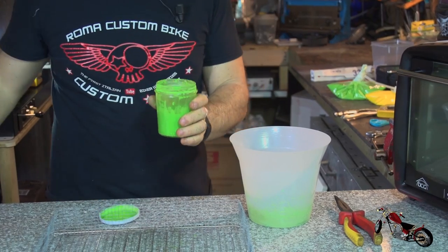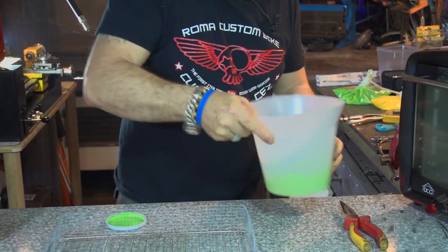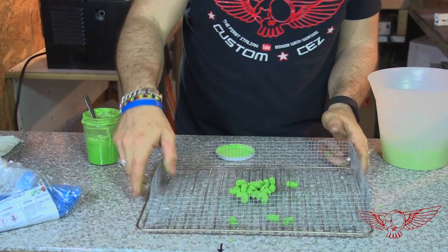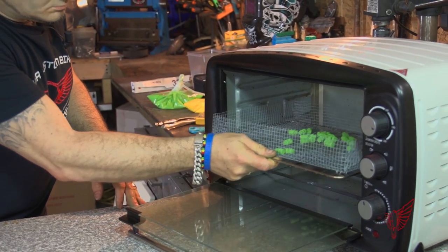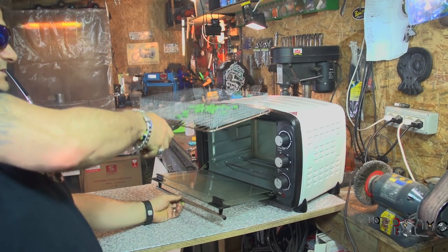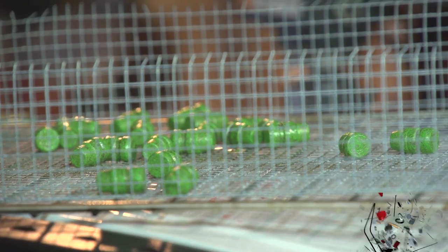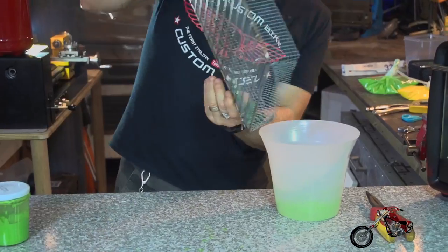I have to make a compromise between the look of it and the thickness each coat adds to the bullet. The good thing is that with this technique the thickness of each layer of paint is so small that even 4 coats are fine. So I start the process again using bullets that are still warm to facilitate the adhesion of the powder — but watch out, if they are too hot it will end up in a mucky mess. Let's go with bake session number 2. You can see that the paint coverage is already much better than before, but let's give it a third coat.